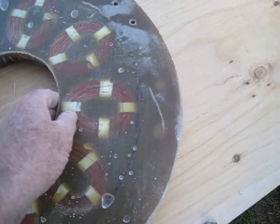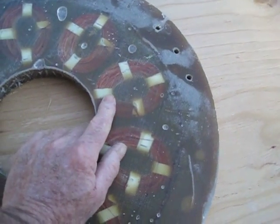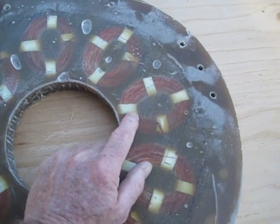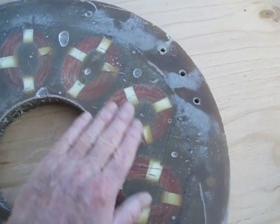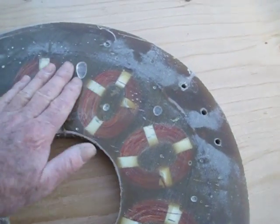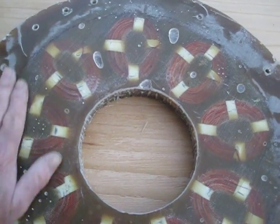This is a pretty good sized stator — it's about an inch and an eighth thick. The coils are slightly over three quarters of an inch thick. They're 150 wraps of number 15 wire. Anyway, I'll fill in the few little air bubbles tomorrow and touch-up sand it.